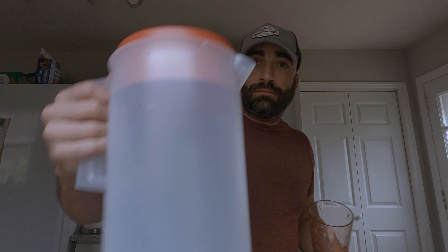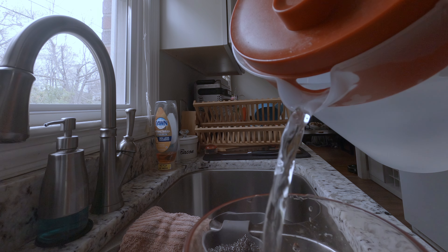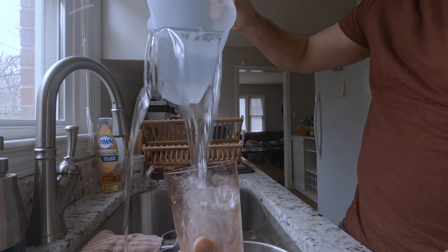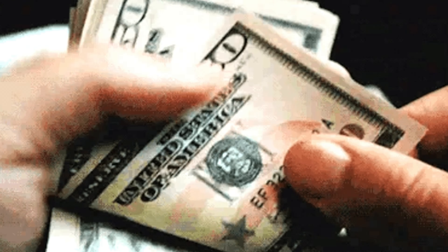You might ask: why can't we just crank up the amperage and charge it faster? Think of the battery as a cup and the charger as a pitcher. At the correct amp rating of 1.5A, the power fills the battery smoothly with no problems. But if you crank it up to three or four amps, you get power quickly but the chance of something going wrong goes up exponentially, and the chance of damaging the battery increases — it's not if it will damage it, but when.